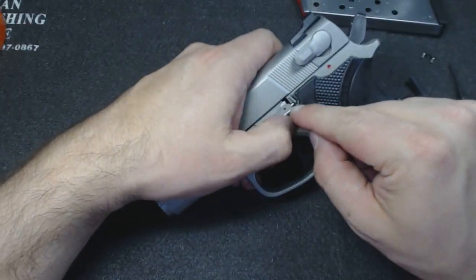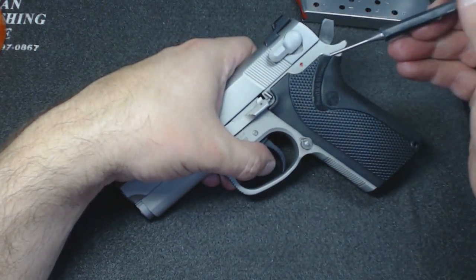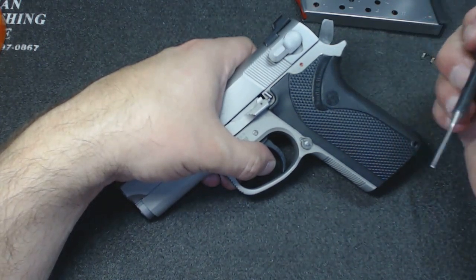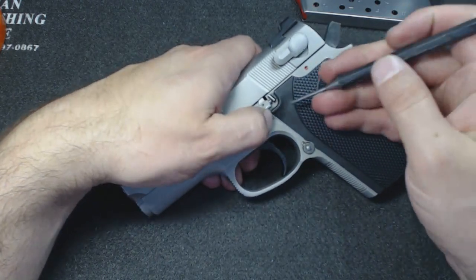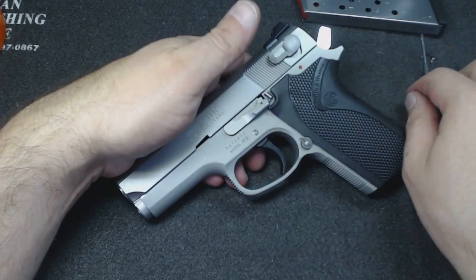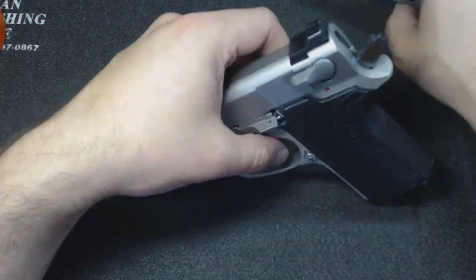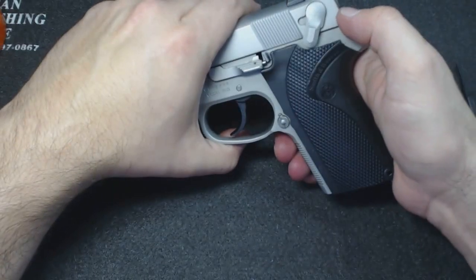It also has a built-in detent here riding on this shelf, which was that big flat piece that held the hammer pin and the sear retaining pin all in there. One big piece doing a whole bunch of stuff. So this is actually what's providing more of that downward force, I think. I think the recoil rod pin is really just holding it from falling out. So I take that back. I lied. All right, hammer drop works.